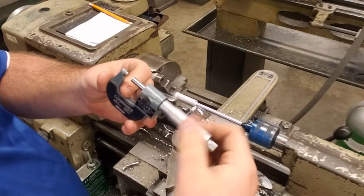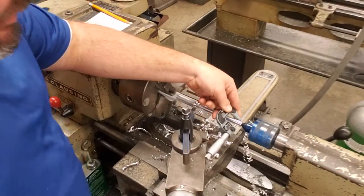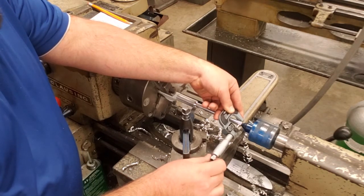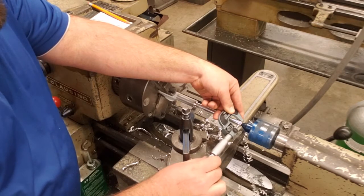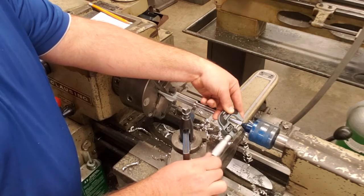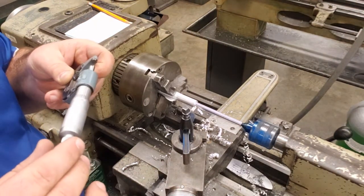Okay? So we're going to place this open first. Then we're going to take our micrometer and put that over top of the work. We're going to turn this part here on the outside, the thimble. Okay, we're going to rotate that, and we don't want to over tighten it. That's why we grab the outside of this thimble right here. We're going to turn that portion. When it starts to spin or click, one or the other, then we know we're at the dimension we want to be at. So if I pull my micrometer off, I'm going to take a reading on here.